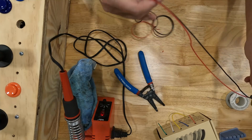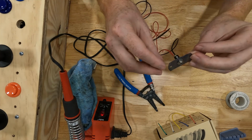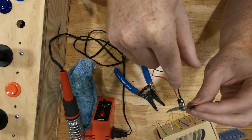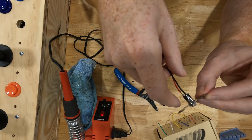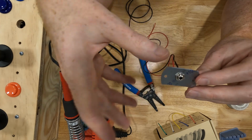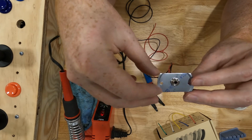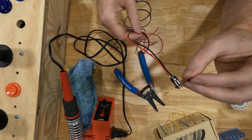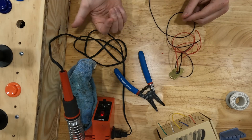So now we've got our audio jack wired up. Now we can install it in our box. Now if you're not comfortable with soldering, I know soldering scares a lot of people. They make solderless 3.5mm jacks, and I'll put those in the description as well. I don't actually have any, so I can't verify that it will work the way we're mounting it here. But I'll send you a link so you can try those if that makes you feel more comfortable. Let me get some of this stuff out of the way and then we'll install this into our box.